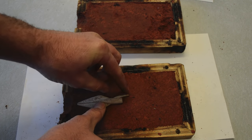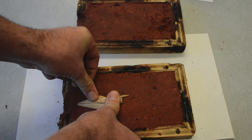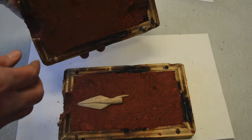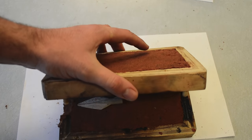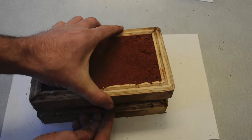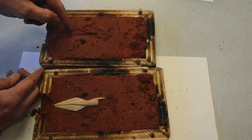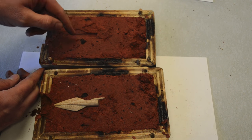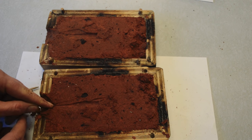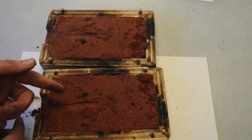You want to get every little detail — the little barb and the blade — so push pretty tight and get it right at halfway. I have little pegs here to line up this mold so they're in the exact same position every time, and I push the top half on to get our full imprint. I can see the little spur, the main rib running down the arrowhead, and the blade, so we have a pretty good imprint. We'll put these back together and I'm going to make a little channel at the tip to pour the bronze into.